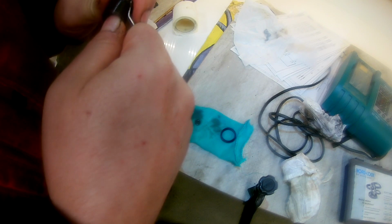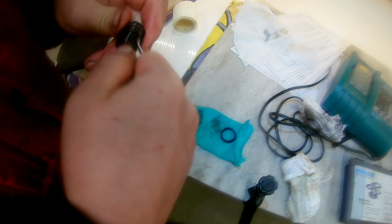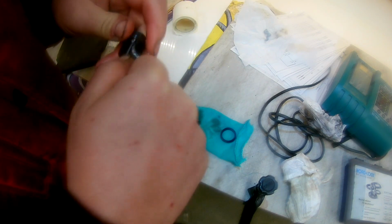Did some measurements on the O-rings on there and how deep the sealing surface was, and they were a little bit flat. Removed that one I for sure suspected was leaking. Took a little bit of care to not damage it anymore. Siliconed another electric connector, sealing it up. There are a few electric components in there also.